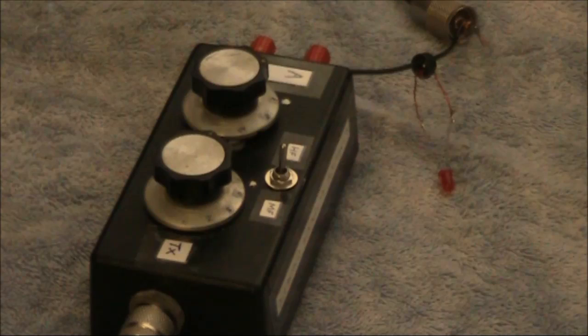There's a clear peak. Now we'll repeat the test, but with the camera on the 817's SWR indicator. Admittedly it's crude, but I find it's generally satisfactory. Again, there's a pronounced drop where there's no bars, coinciding with the point where the LED is at maximum brightness.